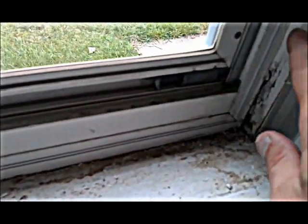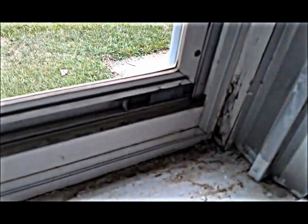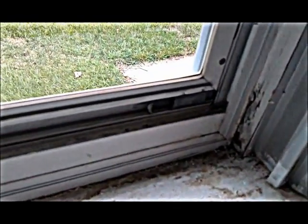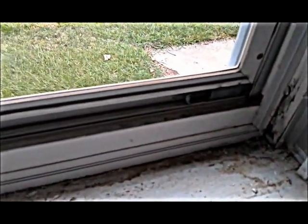Typically what can happen is that water will get in — whether it's where the metal frame meets the wood frame because of lack of caulking, or something leaves a storm open, a multitude of other things. The purpose of the weep holes is to allow that water to go back out to the exterior and not lay on the sill.